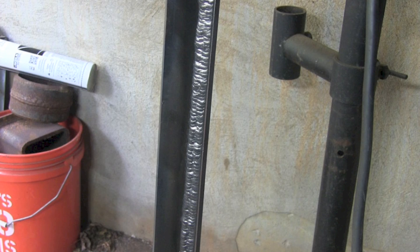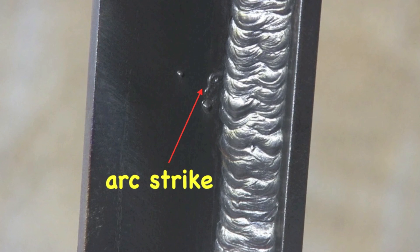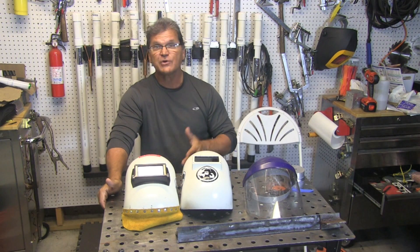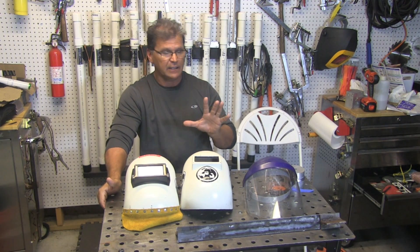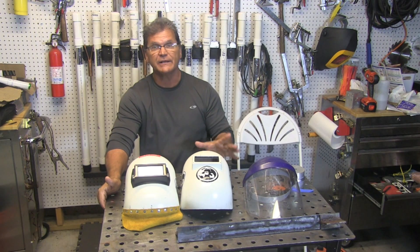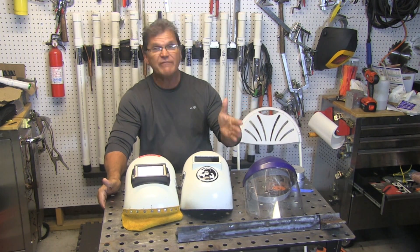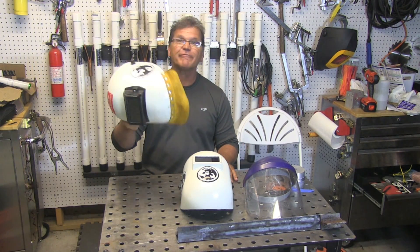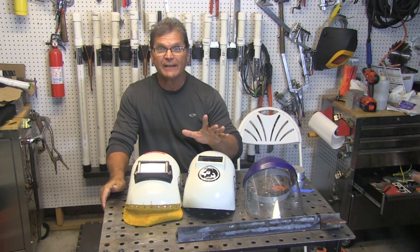Not the worst thing I've ever done, not the best thing either, that's for sure. As hard as I tried to guide where my arc strikes were, I got a pretty nice one right here, so I need to practice. I'll try to do one of these pretty soon — vertical uphill stacking stringer beads — because in the construction and structural welding world, stringer beads are often required; they frown on weaving. But weaving is still used, so you probably need to do both. Thanks again to Alex Brown for the modded pipeliner — it's awesome. Hope to see you at Fabtech; see you next time.